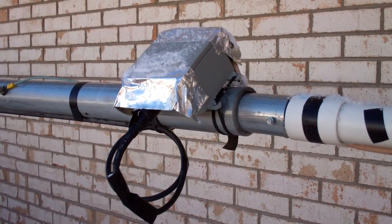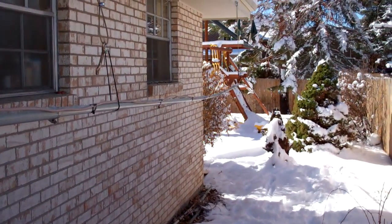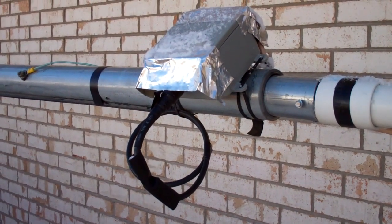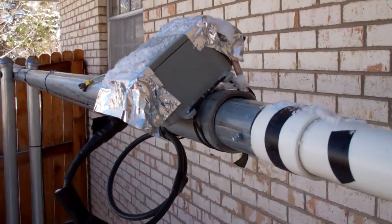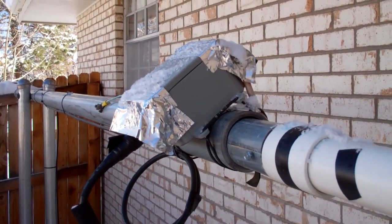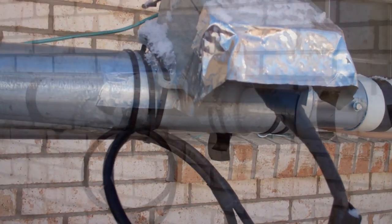Starting from the middle of the antenna, there's a junction box. The antenna is attached by a small piece of PVC, and from there is 27 feet of fiberglass pole which supports the wire antenna all the way to its end. Going back to the junction box, that's 44 to 6 turns of magnet wire on an FT-114 type J toroid. It's weather sealed, but I also put a little bit of foil tape hanging over the connections to keep snow and rain off. They're sealed with electrical tape and checked regularly, so it's not usually a problem. The foil tape creates an overhang that helps with weatherizing.